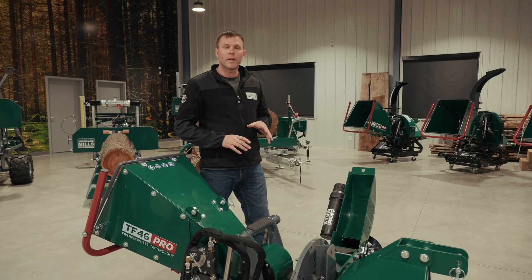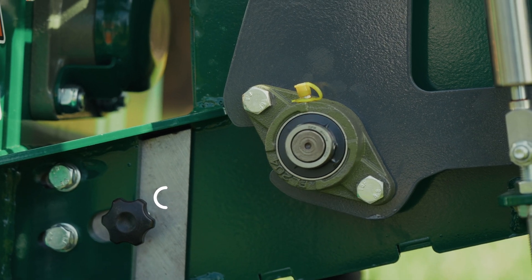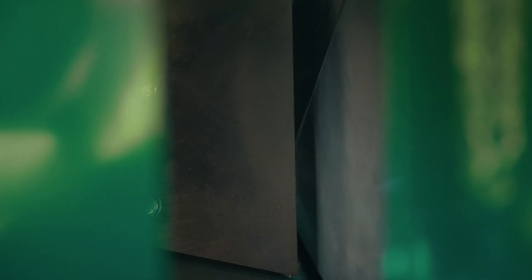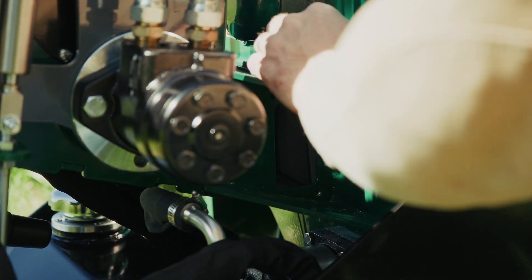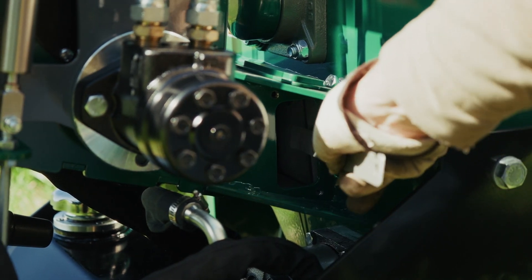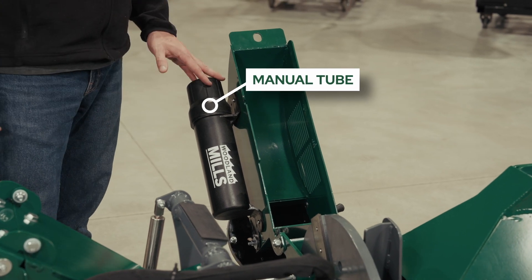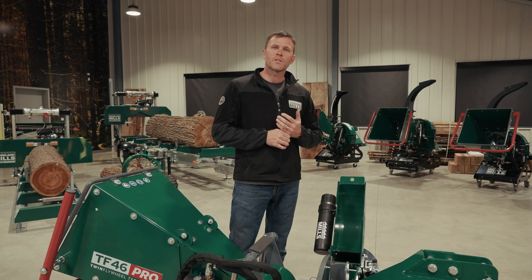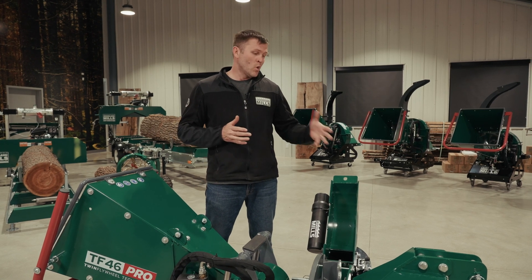Looking a little lower, we'll see the bed plate, which is a secondary cutting edge. If you look at a pair of scissors, you need two blades to make a cut — so we've got the primary blades on that flywheel and then we have our bed plate to make the second half of that cut. The bed plate is tunable; we include a tool to set it and we also have a window that you can open up to get a good visual while using the tool. On the upper clamshell, we have the manual tube, and inside we're going to find the hardware required for assembly plus the manual itself. The manual walks us through the assembly process, the maintenance, as well as the safety precautions while using the chipper.